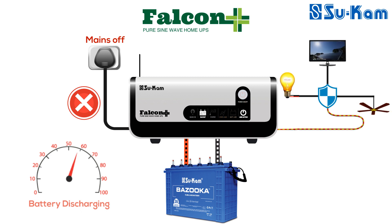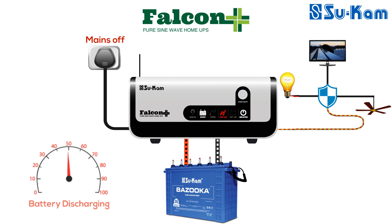The second case is when there is a short circuit in the system output load — the overload LED glows continuously in red color along with a buzzer beep. After detecting the short circuit condition, the system automatically goes off and then on. Through this process, Falcon Plus checks if the short circuit condition has been removed or not. If it is not there anymore, normal working of Falcon Plus will be resumed.